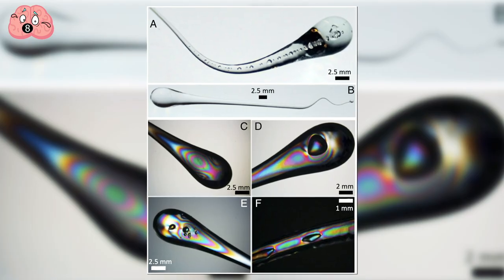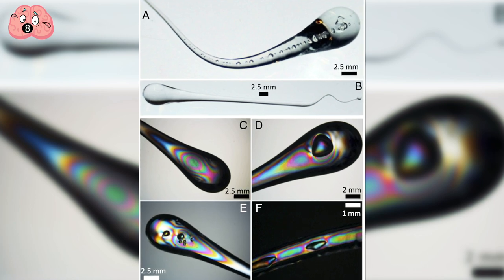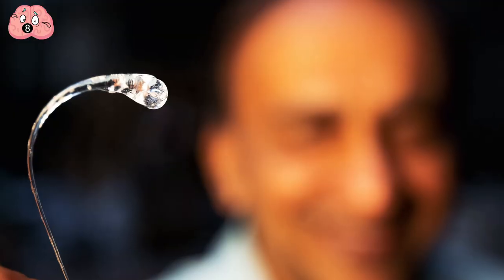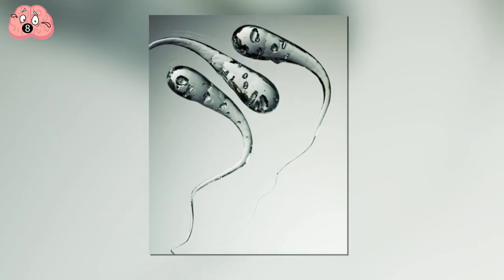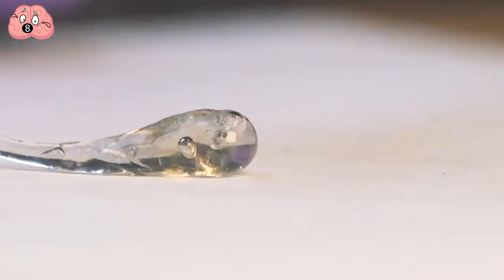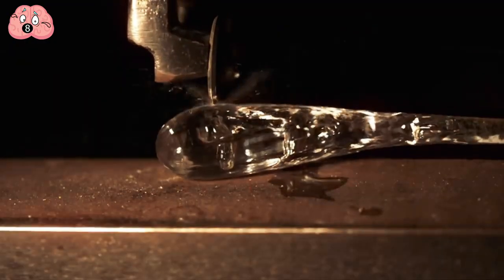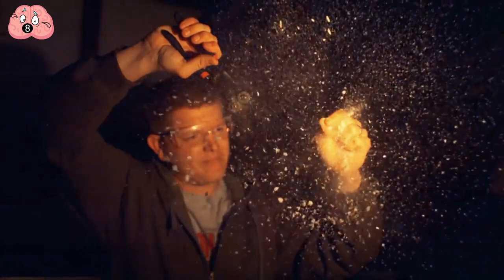The reason for this is due to the bead's internal balancing act of compressive and tensile stresses. After the glass is dropped into the water, the outside layer of glass cools but the inside stays hot. The outer layer shrinks as it cools, creating a solid shape, and once the entire core is cool, the molecules have nowhere to go, so they just shrink. This creates a super high tension inside the bulb. If the tail becomes even slightly damaged, all the high tension is released in a cascade of energy, which makes the entire thing explode.